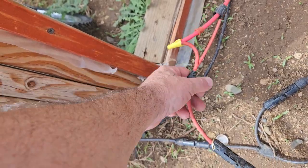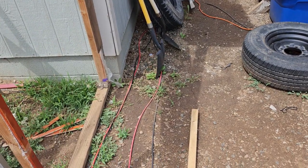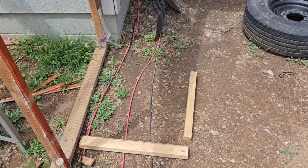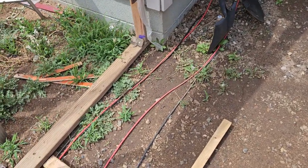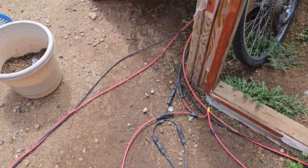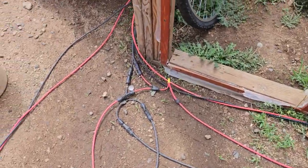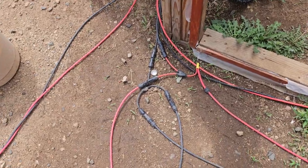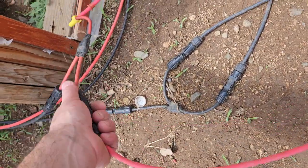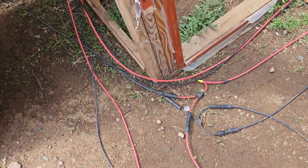So this wire in here goes and feeds. So you have basically, in this case, 2 series, 4 parallel, I guess. But what I'm trying to explain here is that there's parallels upon parallels, and so obviously this is a hazard point right here. And with cheap MC4 connectors, and then running hot and then melting, then we have a problem. So probably none of this is even remotely safe.